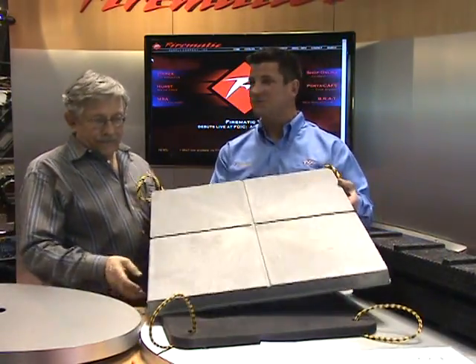So these have always been a very important thing, but now we're dealing with the top of the bag. Underneath that car, or truck, or whatever, is a tremendous amount of garbage. It's interesting that you bring that up — for so many years we've focused on getting ourselves a nice stable environment below the lifting bag, but of course there are sharp protrusions and all sorts of things that could potentially puncture an airbag, correct? In fact, they're guaranteed up there. You don't know what stuff is underneath the truck — it's a landmine of stuff up there. We've also had a compromised vehicle at this point, and that in itself is going to give you all sorts of issues that could pop an airbag.